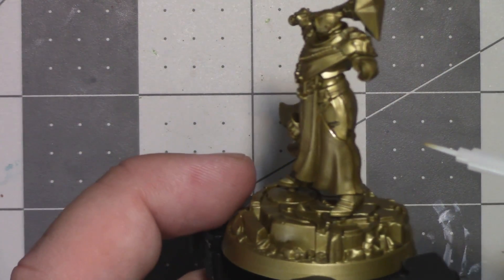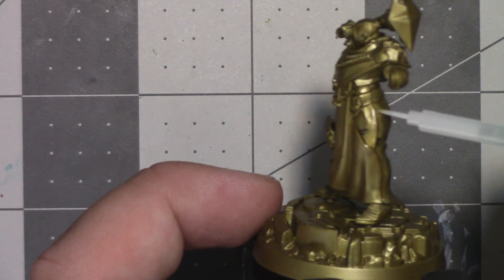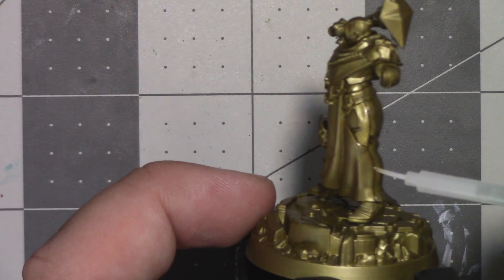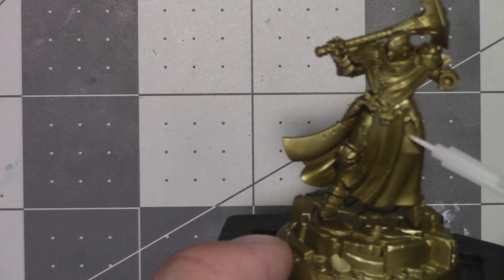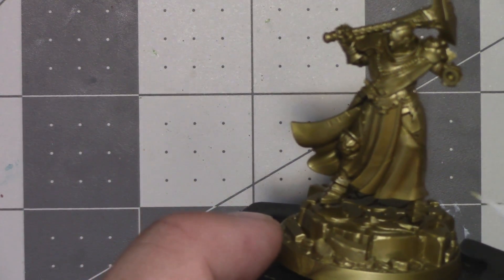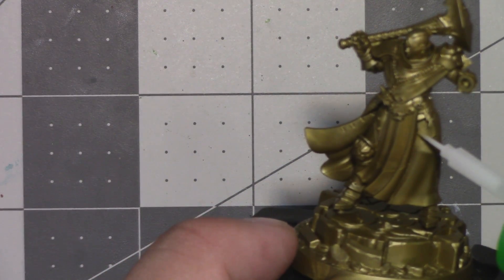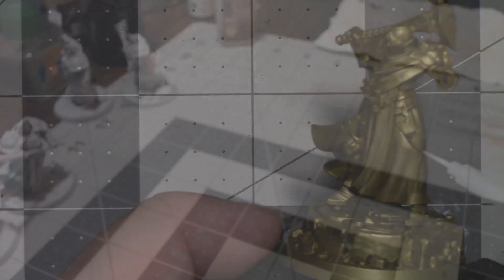One thing that's common with plastic cement is that if the joint was a little bit wider, the first pass doesn't fully fill it. One of the nice things is that as you're sanding, the plastic dust coming off falls into the joint and is effectively welded in. So if the joint isn't completely filled, you can drop in a little bit more plastic cement, let it dry again, and fill it in a little bit more.